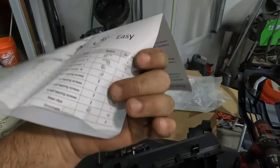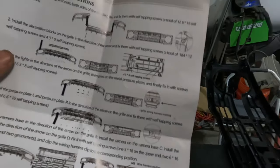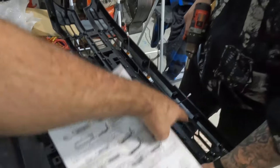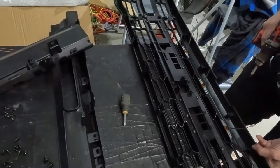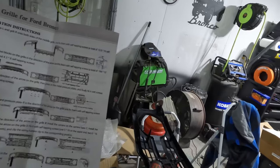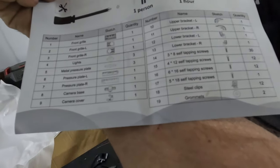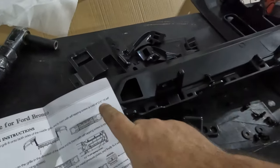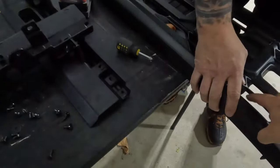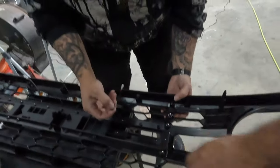Those screws don't fit in there — I think we were supposed to use the 4x16 or 4x12 self-tapping screws for that step. The problem is we can't take those out to use up here because these holes are now too big. The instructions never mentioned using the smaller 4x12 self-tapping screws — it says to use the 6x16, which we did, but those should have been the smaller ones and the bigger ones saved for this step.